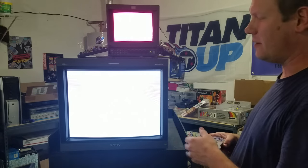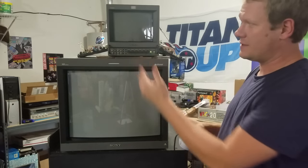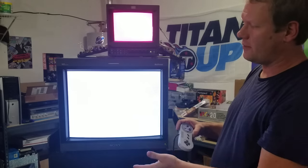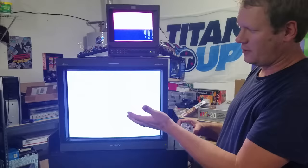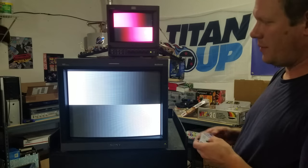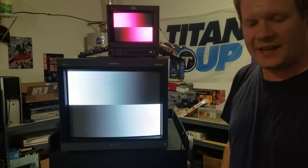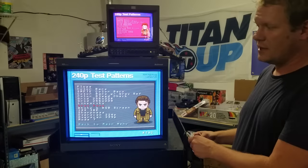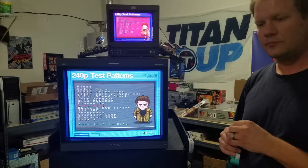I can switch over and remove the text, leaving just the grid pattern — a very good one for color calibrating. Another useful option is the gray bars. What I really like to use is the white RGB screen: you can select individual solid colors — black, red, green, blue, white — and compare them. Red's not far off, but green is extremely off, and white is extremely far off. A gray ramp is also helpful because gray tones act as a good indicator as you adjust these potentiometers.